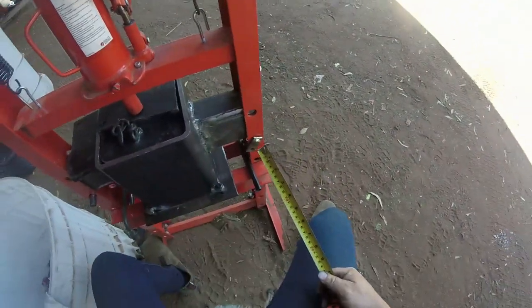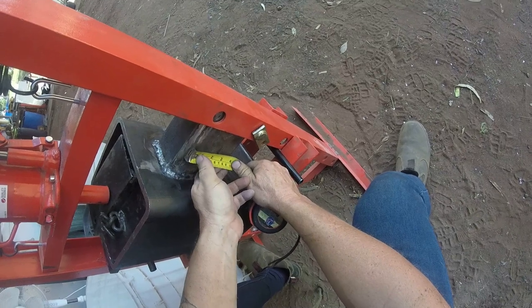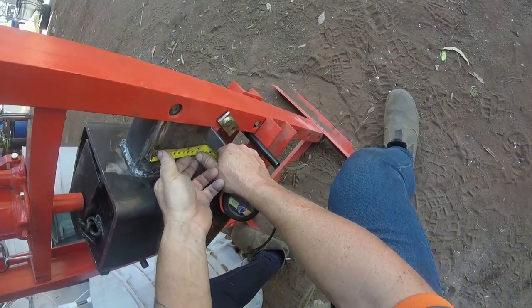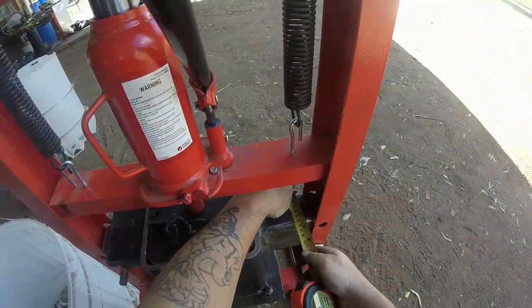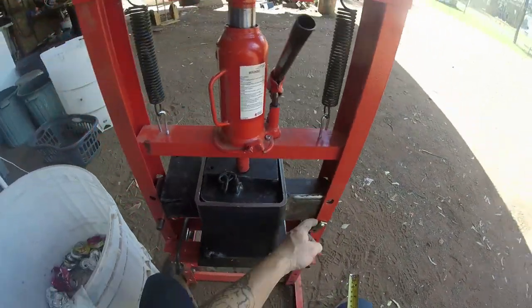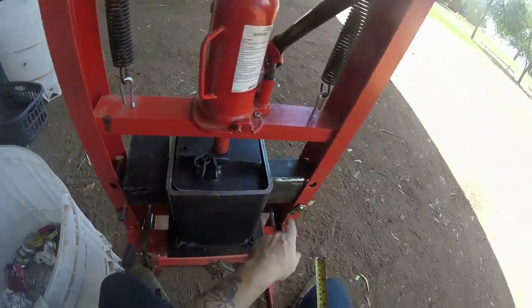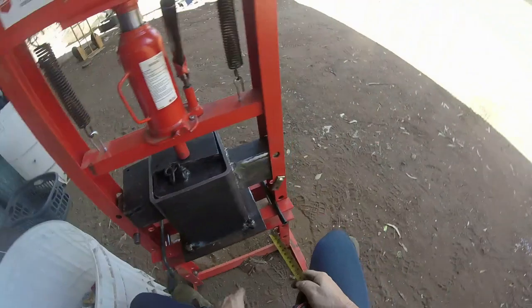These box sections that I have here, they were angled off, I think it's about there where I joined it. I think it was 100 by 60. I had to chop some off to fit it in here because it was too wobbly. So yeah, I chopped it off and I had to bevel the edge in to get that decent weld and that sort of thing. Same as all up here.